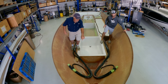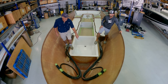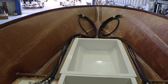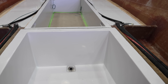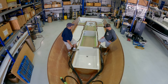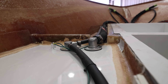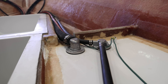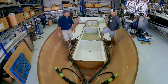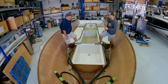In the front of the boat there's a drainage pitch that goes all the way down to the back. This is actually going to become the water tank in the bow — we're just checking that nothing's leaking at this point. This is our fish box. You can see the drain is cut, the flange is cut, and we put a recess in there to get the drain as low as possible. Fuel tanks are in — they're about 103 to 104 gallons apiece. Four-pound density foam all the way around them, and then we glass the tops so no water can get into the foam. These are the new EPA fittings, so the vent you used to see on the sides of the boat now just goes into the gas cap itself. It takes about 6 to 8 percent of the gas capacity out, but it keeps the government happy.